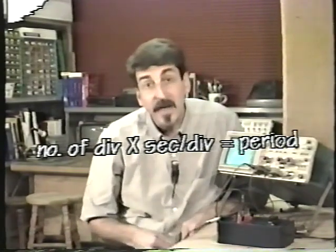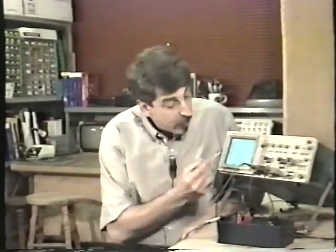Well, I happen to know that it is, in fact, 16.66 milliseconds. And I know that because that's the period of our standard 60 cycle or 60 hertz AC power. 16.66 milliseconds is the period of our 60 hertz power, and it's a number that you're going to come up against again and again when you're troubleshooting. So it's a number you'll learn to recognize. And here we have just over 3 divisions, and it looks like about 16 and a half.